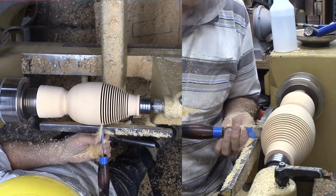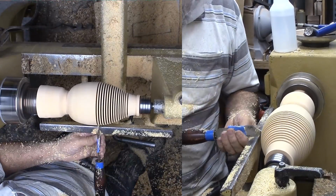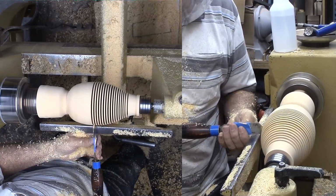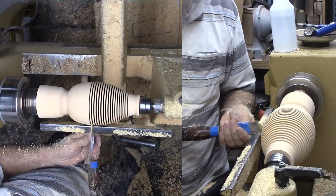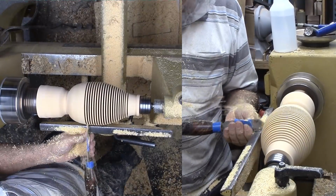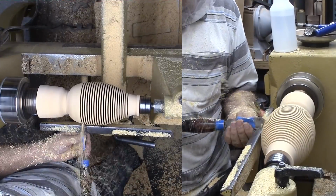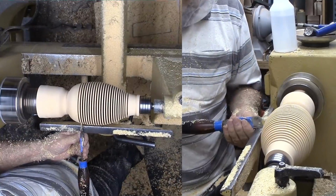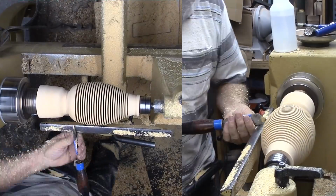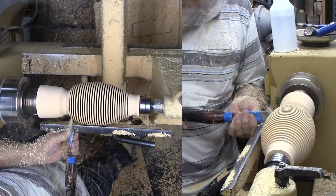I positioned my tool rest perfectly parallel to the ways and put tape on the parting tool to mark my depth. After each cut, I move down. It's hard to position each groove. I find it easier as the diameter enlarges to move down the 1/4 inch to start, since my tool seems to want to slide downhill. And so on to the bottom of the vase.